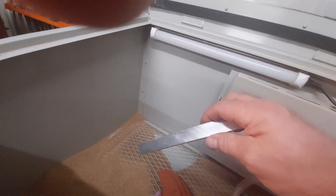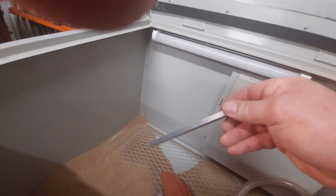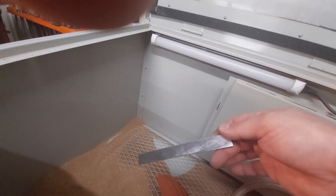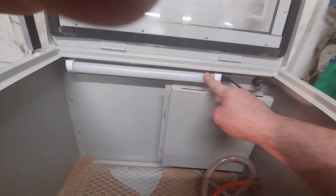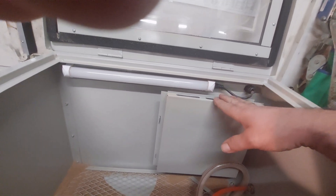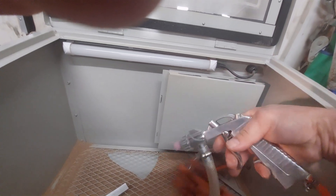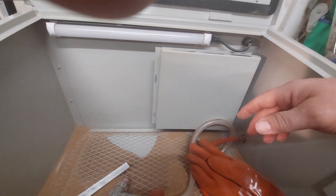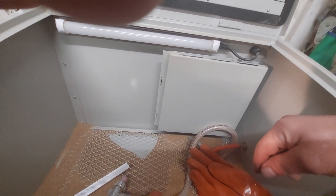What I've got here is just a piece of aluminium that's been cleaned up with 120 grit abrasive, and I'm going to see what sort of finish it generates — whether it can get rid of the 120 grit scratches and whether it gives me a uniform finish. This process is going to be quite noisy. The unit has an LED light and an extraction fan which is quite noisy, and it runs on compressed air with a compressor that will kick in and out. So I'm going to set the camera up on a stand and have a go at blasting this piece of aluminium.